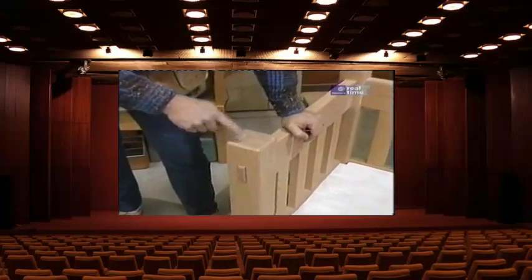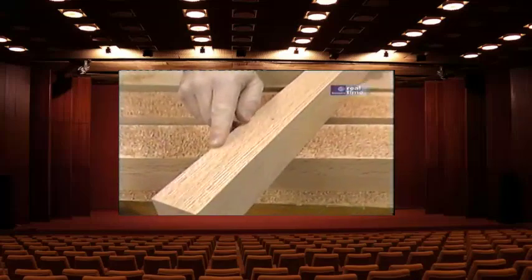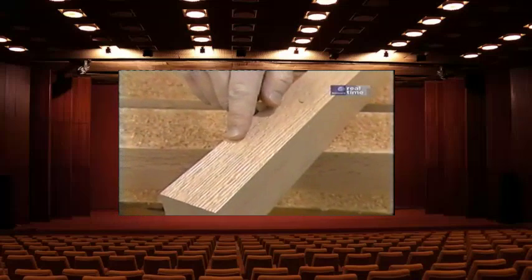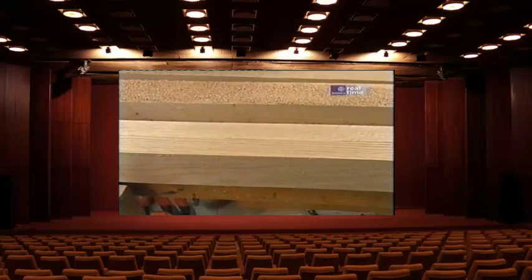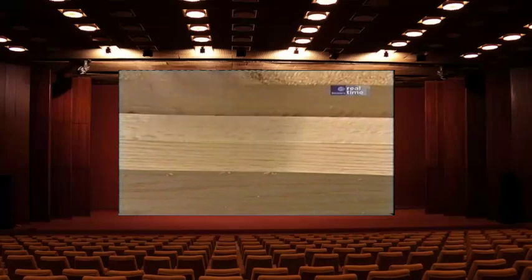When I went to buy the material, I ran into a problem. I wanted four-by-fours for the corner posts — solid oak — and I couldn't find any unless I was willing to wait a long time or pay a premium price. But I was able to find some eight-quarter-by-four oak: three and a half inches wide, an inch and three-quarters thick. If I glue two of them together, I end up with a piece of four-by-four. Even though the material was good quality, when I glued it together I still ended up with a slight variation, so I have to even it up using my thickness planer.